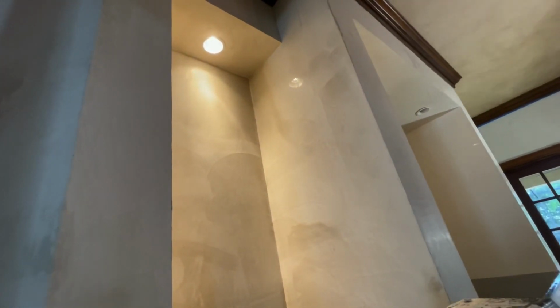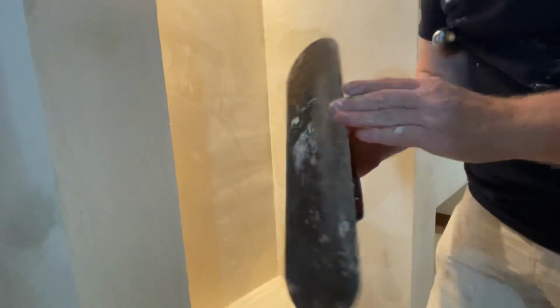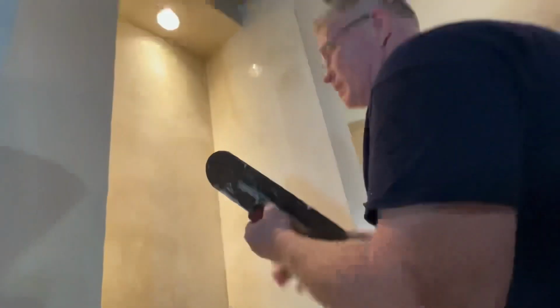So we're using stainless steel, right? Okay, stay right there with your camera. Keep the camera on that. Now, let's go to a carbon steel applicator. Here's our carbon steel. Take a 600 sanding disc. Go all around your edges, okay? Once you're sure that you don't have any scratches in your edges, you take your carbon steel. And you just burnish it like that.